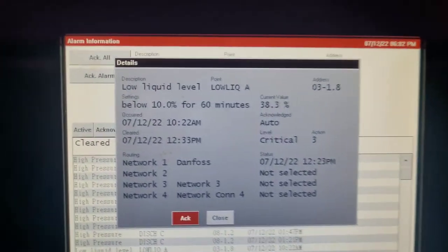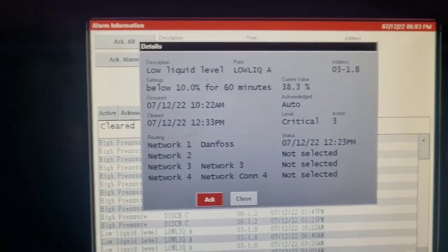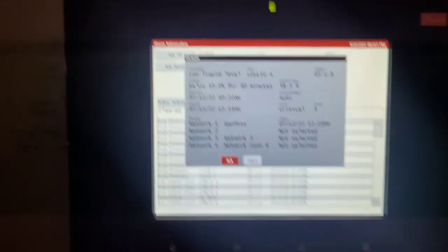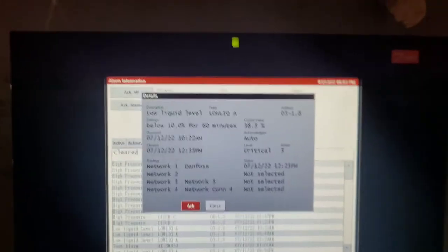Got two jugs in. I'm going to go up here and check the liquid level and then wait about 15 minutes and check the liquid level again. After putting just 50 pounds in it, right now it's showing a 38.3% value. I don't know if that's true or not, but if it is, then we're definitely not going to need all that refrigerant. I'm going to let it run for about 15, 20, maybe 30 minutes and see where it's at again.